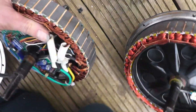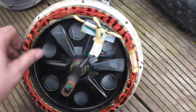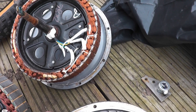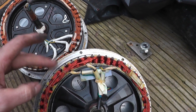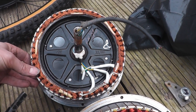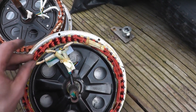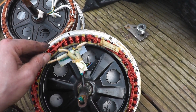All of these have the same 28mm wide magnets. This one is rated at 500 watts and this other one is also rated at 500 watts - ignore the rust - but notice any difference? This one has significantly less copper than this one. The other has a much deeper amount of copper, tighter wrapped around the laminations. This one is quite loosely wrapped, nowhere near as much copper, and it's actually shallower - the bottom of the lamination is shorter.